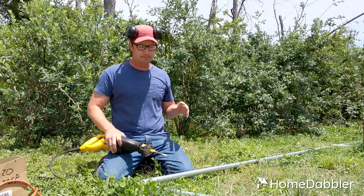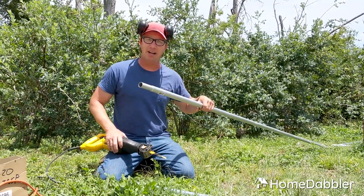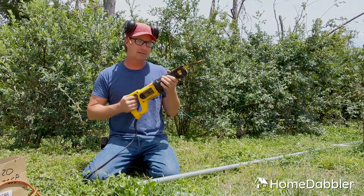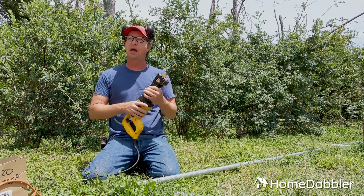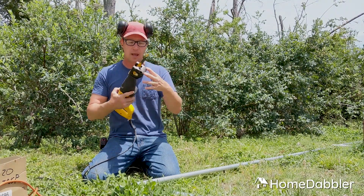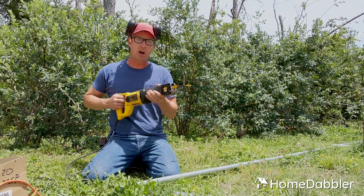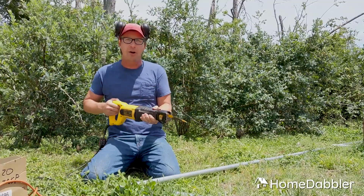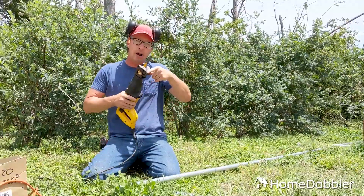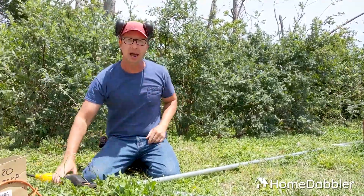I want to show you how it works really quick on this metal bar — it's going to cut through it like butter. One little technique with the sawzall: this is a pretty violent tool, it's just rough and ready to go. You see this shield right here, this guard? That's made to really push up hard against the material you're cutting, because if you don't do that, the saw is going to whip you around — it's going to reciprocate you. So what you have to do is put some pressure against that plate right there and let the saw be the only thing that moves. All right, so let me show you how it's done.